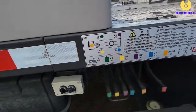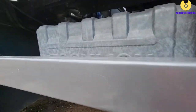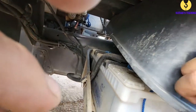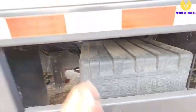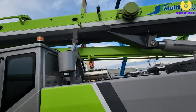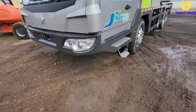Our controls are clearly labeled. Under here we have our batteries — make sure your batteries are in there nice and secure, and check for any corrosion on the terminals. Check both battery compartments and make sure everything's firm. Remember, if you do open anything up, make sure you close it back down again — you don't want to drive off leaving it open. Up there you've got your boom angle indicator — have a look at that to make sure it's nice and free. Keep checking down along this side of the boom for any structural damage. Coming down, check wheels and tires, steps, decals, mirrors, and light lenses, and we're back to the beginning.